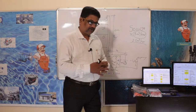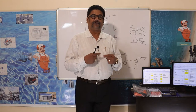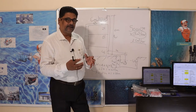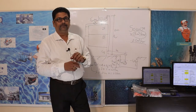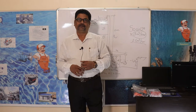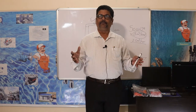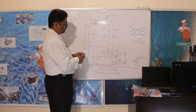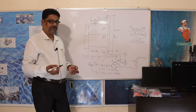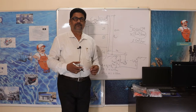You also need to take the frequency of operation into account — I'll deal with that a little later as it may sound complicated today, but you will understand why it's important. When calculating peak demand, there are many ways. For 20-30 years, people used the people's method: 200 liters per day per head. For example, each floor has two washrooms — six washrooms total — so 200 liters times five people per flat equals 1000 liters per flat. That is a crude method of calculating.